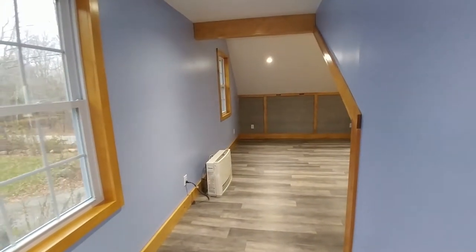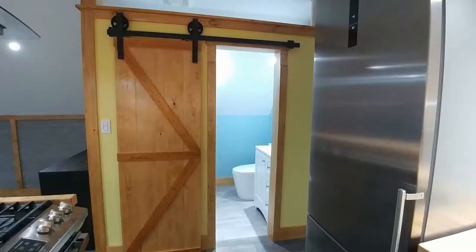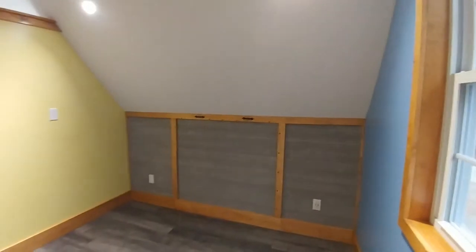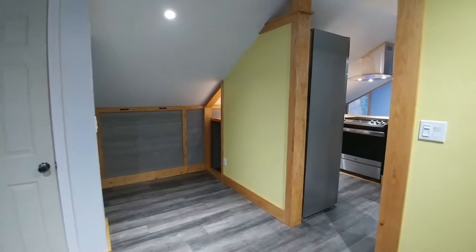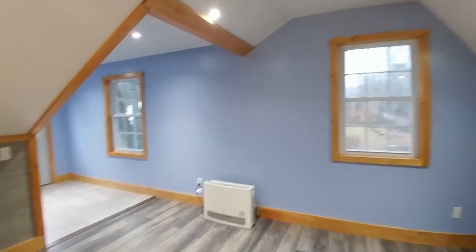So this week's video had me having massive flashbacks about all the wood trim I had to cut and finish for the apartment that I built on the second floor of my carriage house. The whole cut, sand, stain, let dry 24 hours, first coat of polyacrylic, let dry for 24 hours, light sanding, second coat of polyacrylic, and let dry 24 hours before I could install the trim pieces.